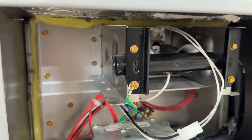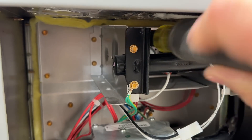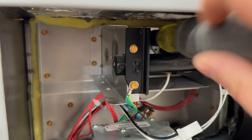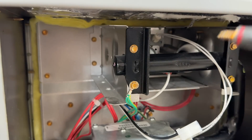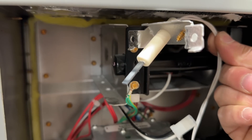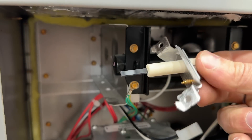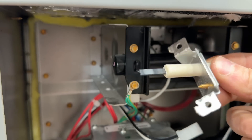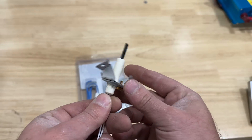You don't have to be super careful taking this out if you know the igniter is bad, but with a new one — and especially the old-style hot surface igniters — you want to be really gentle because they can break very easily. That is what a hot surface igniter looks like. This is on a newer furnace, but I'm going to show you what the older ones look like — this is what glows red and ignites your gas.